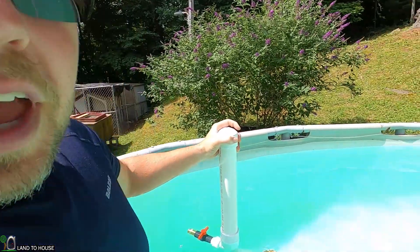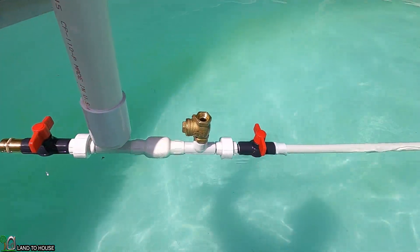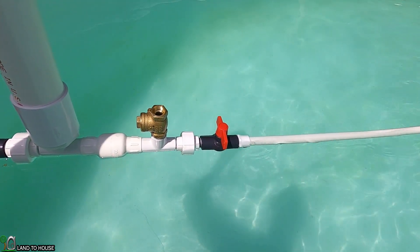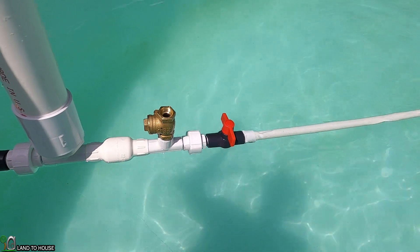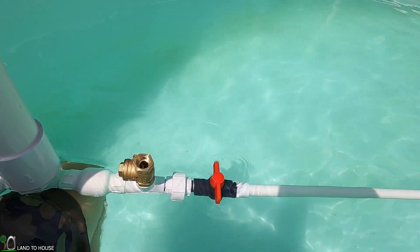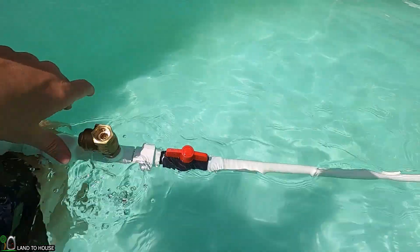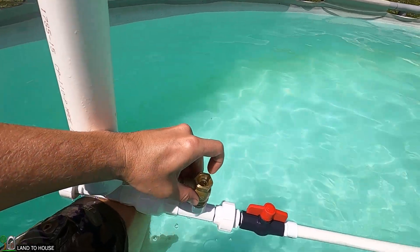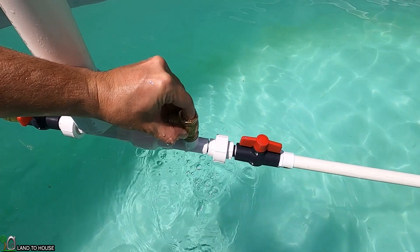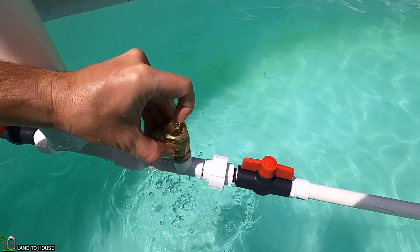I have the pump in the water now. To make this test consistent, I'm going to start manually cycling the waste valve until the pump begins to operate on its own. Then I'll close the drive pipe to stop it, and that's when I'll begin the timer. There's no pressure in the tank right now, which is why I have to manually press the waste valve down. As soon as it begins cycling, I'll close that drive pipe.